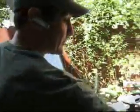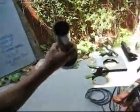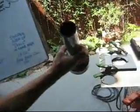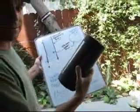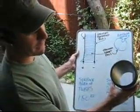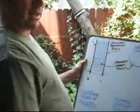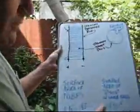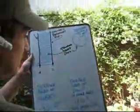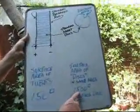With our first design, which was similar to yours but smaller because we used conventional tubing available without machining or welding, we got a pretty good distance — I think yours is .065 but it works. We were thinking about taking this piece of plastic we got, which is 3.75 inch inner diameter. So we thought a 3-inch disc, a bunch of plates, and then we started crunching the numbers. If we filled this thing up with the plates we're designing, as opposed to our original design that had 150 square inches, we'd have 1,500 square inches.